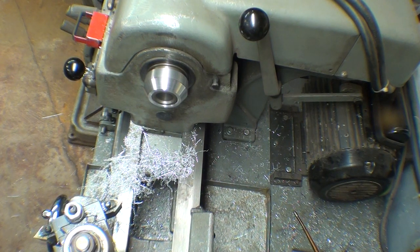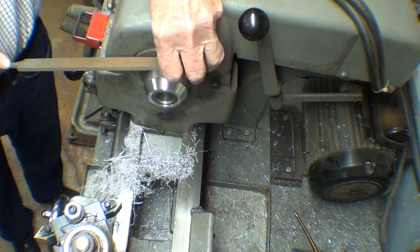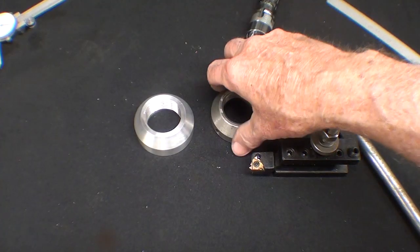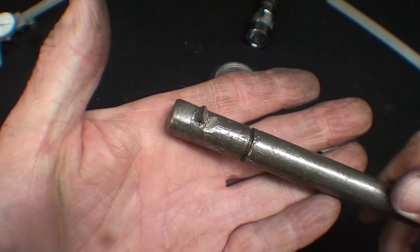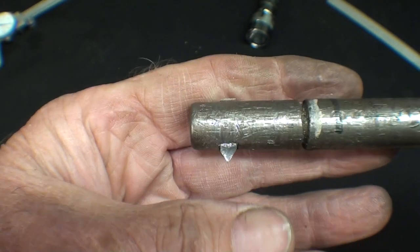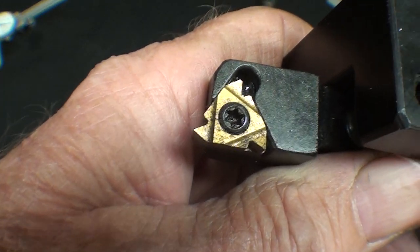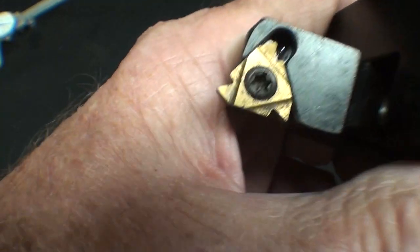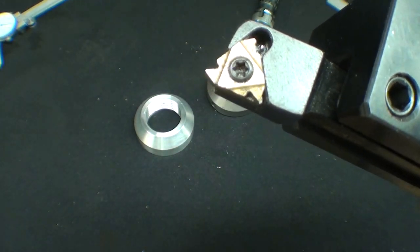Where's my file? And that's it. Next I need to drill that hole for the spanner. Before I go over there, this is the tool I was using for threading — it's just a little 3/16ths square ground at 60 degrees, left from another job many years ago. But what I really wanted to use, and I don't have one, is a boring bar that will hold a threading insert. It would be a different one to fit in the boring bar for internal threading, but that's on my want list. Those are pretty nice — that's from Shars. I'll meet you over at the Bridgeport.